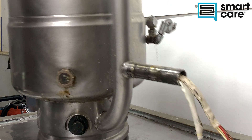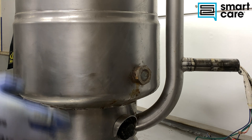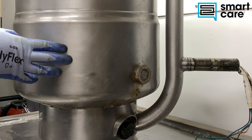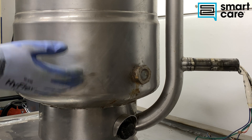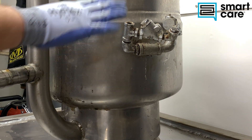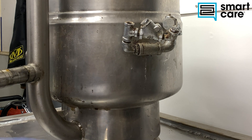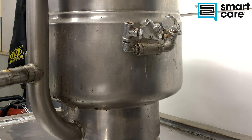That water, because it's constantly steaming and condensing down on this lower jacket portion, it's really critical that it not have any impurities that can be left behind on the heating elements. So these always have to have distilled water in them with no mineral content. Additionally, some kettles also call for a rust inhibitor to go into that water as well. When the kettle is cold, the pressure gauge should be showing that the jacket is in a vacuum, and that vacuum is critical to how the kettle functions and for it to be able to regulate temperature correctly.